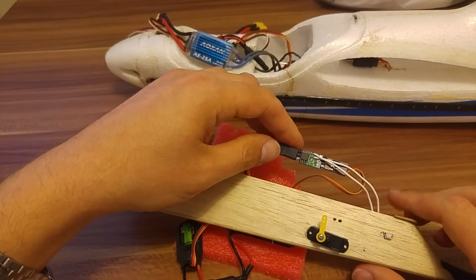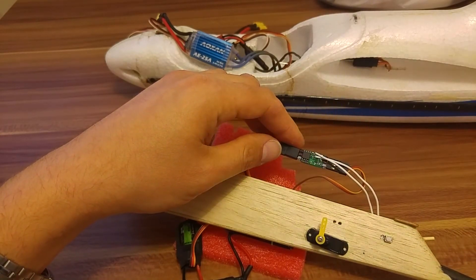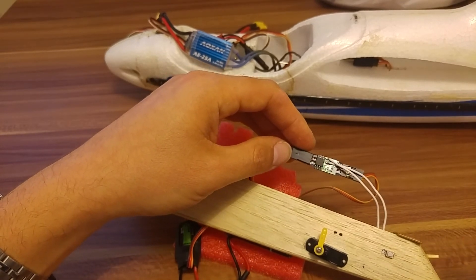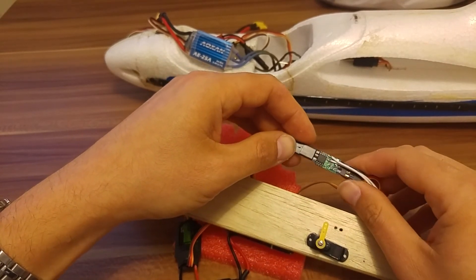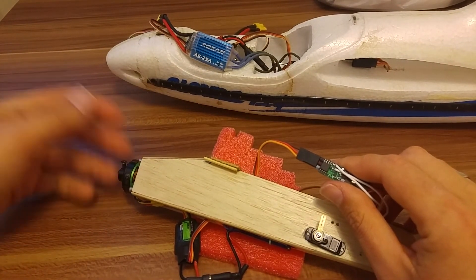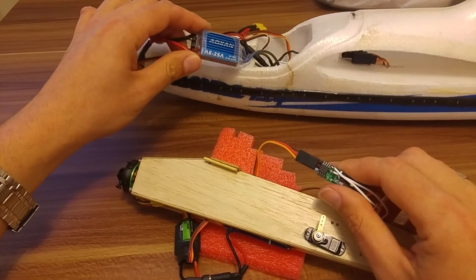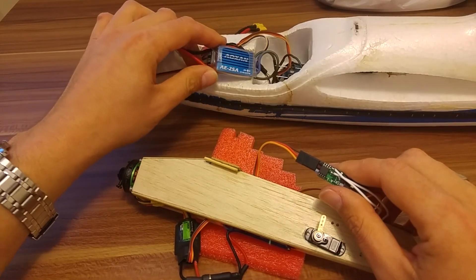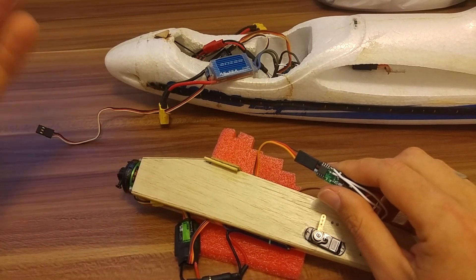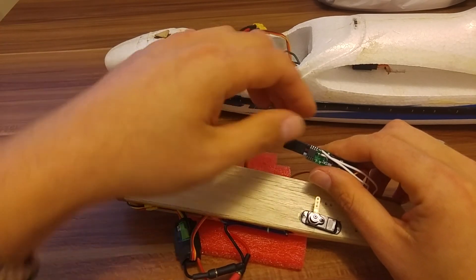Before this feature, the motor did not start because it didn't know what the minimum throttle was. The ESC didn't know how to interpret the signals from the timer when using an extremely low throttle like it was. Most ESCs should handle it if they don't try to make an automatic range of throttle like this one. I hope you like this video, I hope it's helpful, and thank you for watching. Bye-bye.